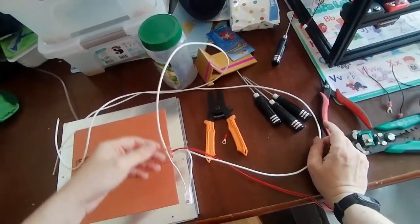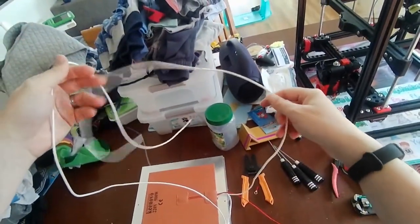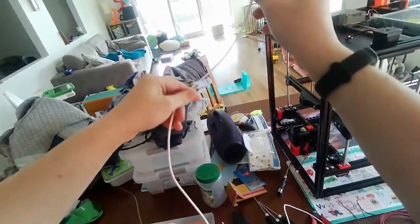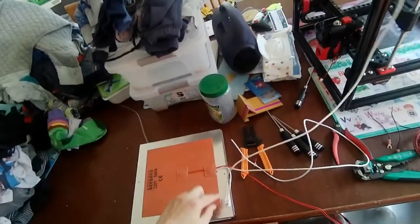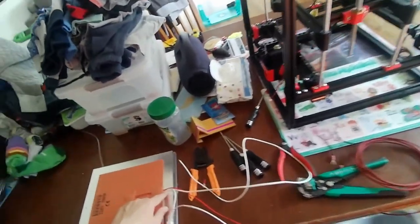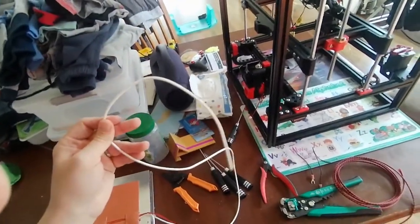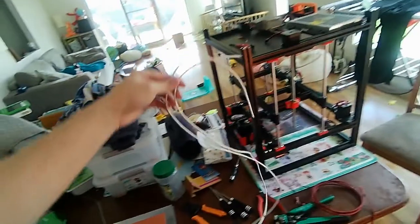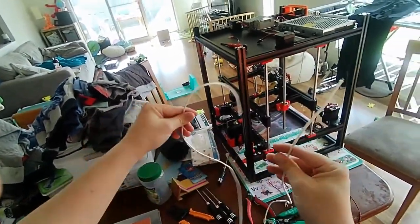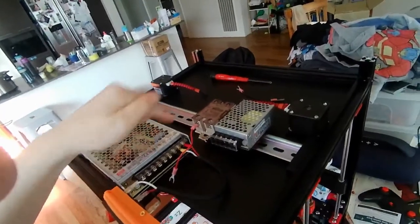So we have two wires here now. You can see how it's basically a pass-through kind of thing where power from my line will go down here, through that, into this bed. And then the neutral wire will go into my power supply. So one to the power supply, one to the SSR. The other one, which is ground, will have one more wire that goes to your heated bed. So then you've got three to your heated bed, two to the power supply, and one to the SSR. Make sense?